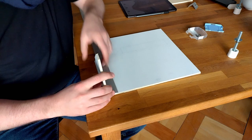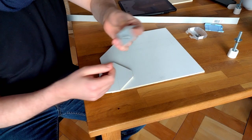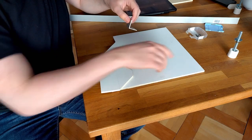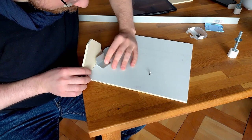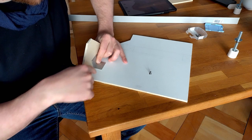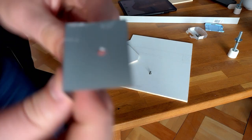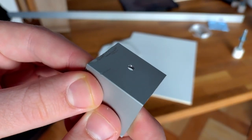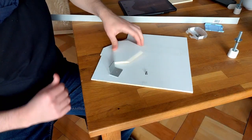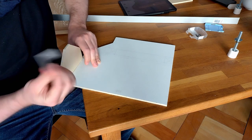So, even more fun, and I actually already went ahead and prototyped a little. We're gonna make such brackets a little bit prettier than this one, but maybe not much prettier, and put them in here. And instead of putting a wood screw in here and punching through that, we're gonna be even more compact. We're gonna make a hole here. And then, if you look precisely, you can see there's a threading in here. And we're gonna make a threading ourselves, and then we can use a very small screw and come in from the other side, from the wood, and screw into these pieces of metal.